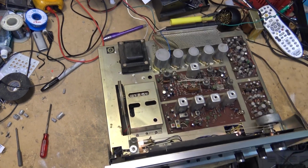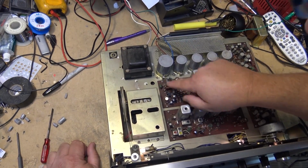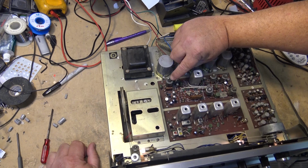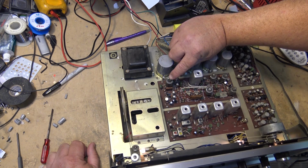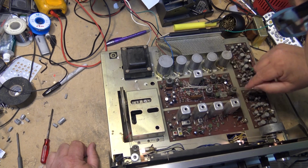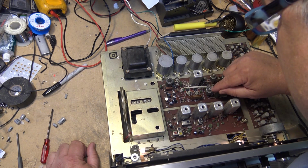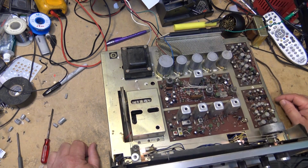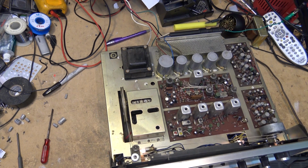So that's all it was, just this coil. It shows where it was marked. I just had to turn it over about a third of a turn. Not even that. There's a dot here, right, where these were the line from the factory, and I just had to tweak this one ever so slightly, and that seems to have solved my problem.